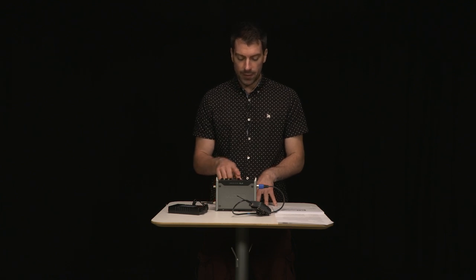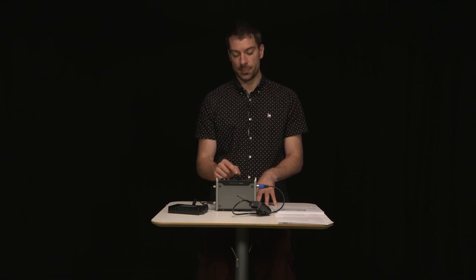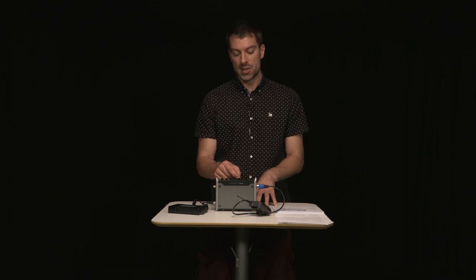Okay, moving on, without going too deep into one particular aspect of it, the headphone level is down here, and just be very conscious of this because the headphone level is an output volume level. So this does not change the input volume recording, the level at which the individual microphones are being recorded onto the disc. So this is generally something that you set carefully after you've done everything else.